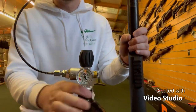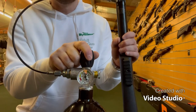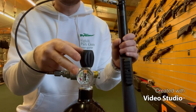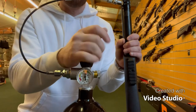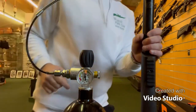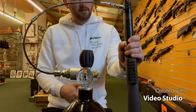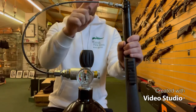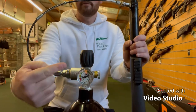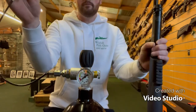And then what we want to do with this gun, we fill to 200 bar. 200 bar is pretty much directly in the middle of the gauge. So increase the pressure, the slower the better, so you don't damage any seals. Once you've reached 200 bar, which you can see we're about there, close your main valve, just like that. And we need to release the pressure out of this pipe. If you don't release the pressure out of that pipe, when you pull the probe out, you'll burst seals, and the chances are the whip, this piece, is going to smack you in the face. So you need to bleed the air out like that. You'll see the gauge run back down to the bottom. Once it's run down to the bottom, pull your probe out,